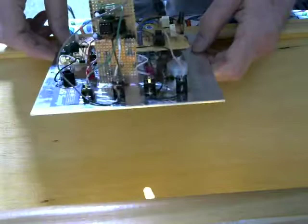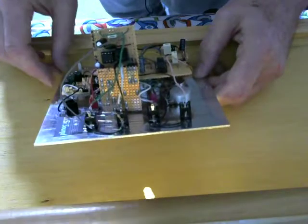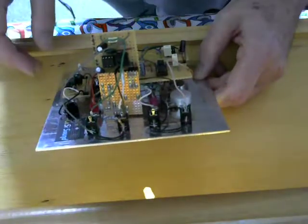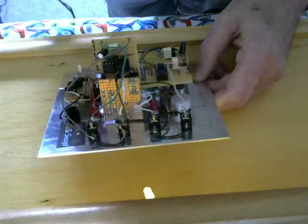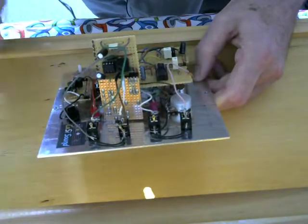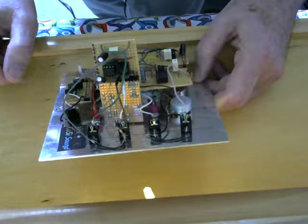So what I've done is I have a second circuit which I've piggybacked onto the oscillator circuit, and this is an LM386 amplifier. From the chip's data sheet I've taken the circuit design for a 200 gain amplifier. The thing sticking up here is a trim pot, and I've put a thumb wheel on it so I didn't want to mess about with screwdrivers. That basically allows me to trim it so that I get the optimum output from the oscillator. The oscillator on that circuit also has a VACTROL on there to provide the CV input.